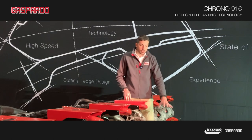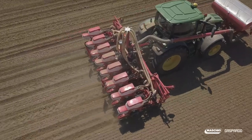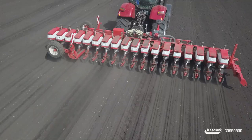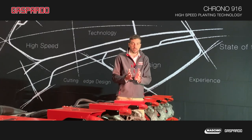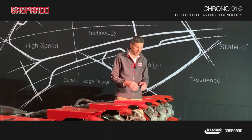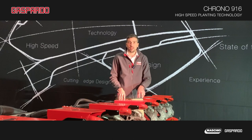The heavy-duty tail is made with solid cast iron, with an adjustable spring for downforce and adjustable wheels to perform perfect closing of the furrow. The two wheels can also be staggered when working in rocky ground to avoid clogging. Available options include 1-inch rubber, 2-inch rubber, as well as heavy-duty cast iron for the toughest applications.